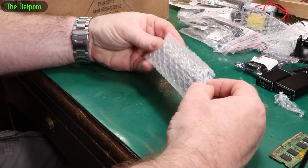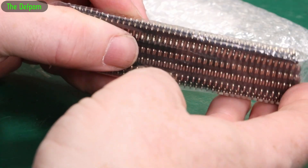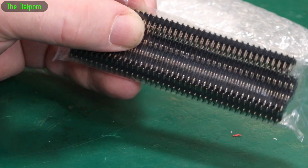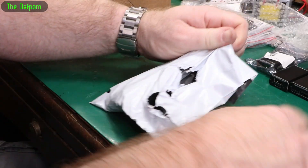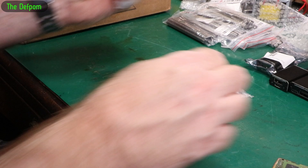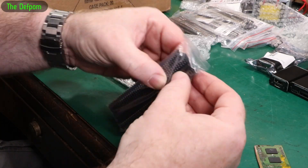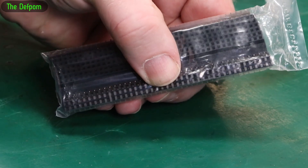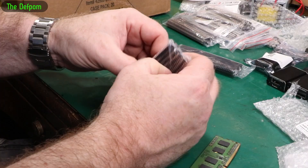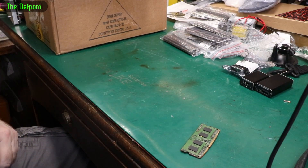More headers! These are some really small rectangular pin ones, but really short ones for nice tight spaces. You can actually do PCB interconnects in a nice confined space. This is definitely getting ridiculous. It could be some more headers — 40-pin. Same sort of thing as I just showed but these are female ones. Surface mount dual inline — that's what these are. And these are some compact single inline ones. I don't have a header problem. Not anymore, anyway.